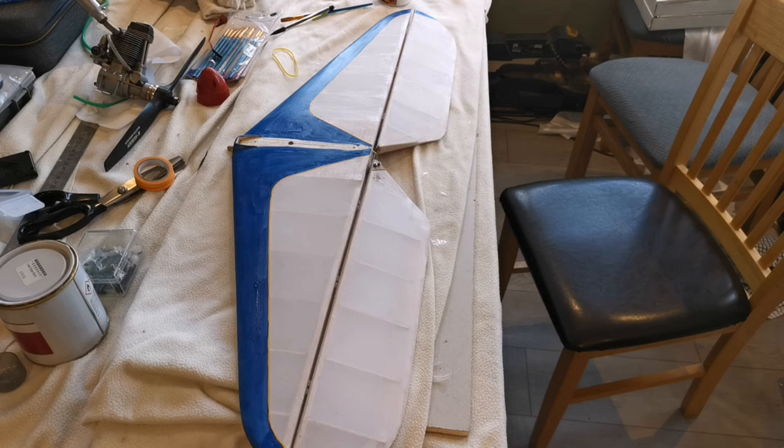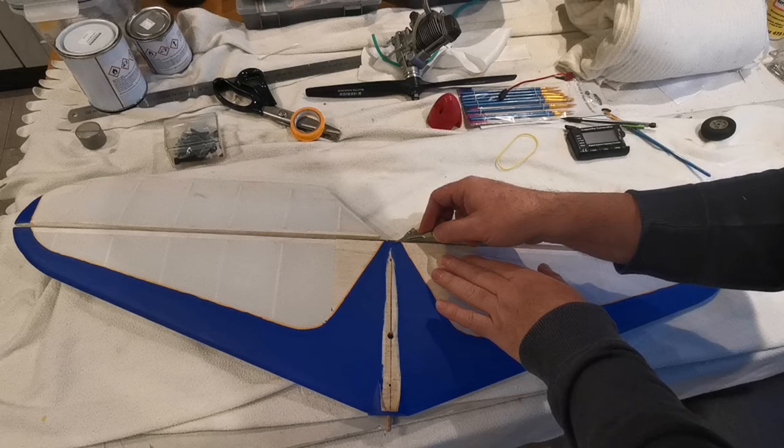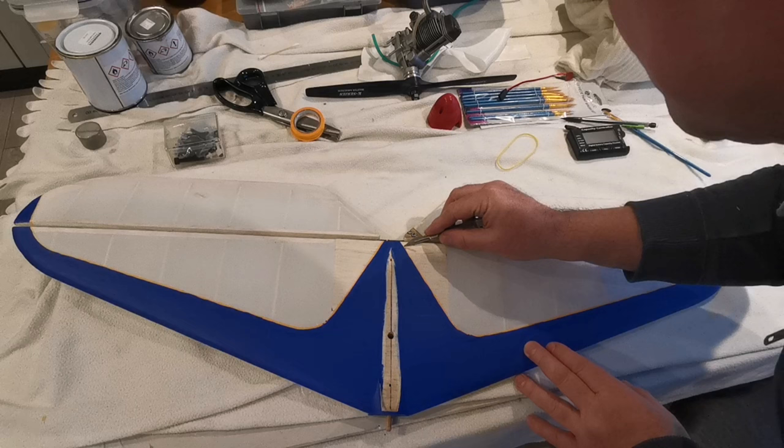I'll do the other couple of coats that will be necessary, and then we'll finish off with a little bit of a video of the removal of the tape and we'll see how things have gone. Here we go then — that's the final coat applied and it's dried. I'm now going to remove the masking tape, and if all's gone well we'll be left with a nice crisp clean line without any bleed going underneath — pulling it back on itself.